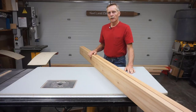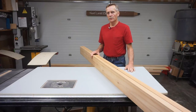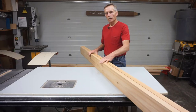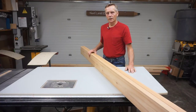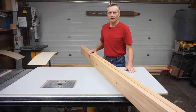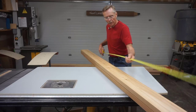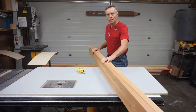The size of the finial on the obelisk meant that I needed a pretty good size blank to turn that finial from. I could use a piece of 6x6 to make the blank, but because the finial is just over 2 feet long, I didn't want to buy an 8-foot 6x6. So I'm going to laminate some cedar 2x6 to make the blank. Because of the relatively low cost of the cedar 2x6, I'm going to go ahead and make blanks for 2 finials. I'll rough cut the 2x6s into thirds and mill them from there, because that minimizes the effect of bow during the milling process.